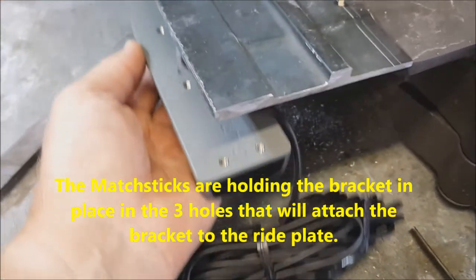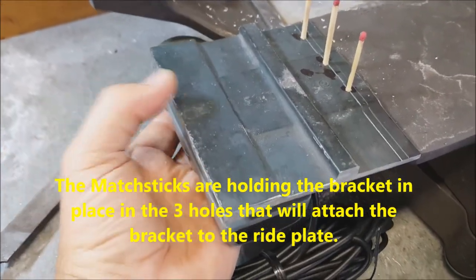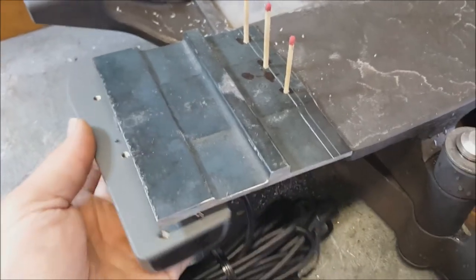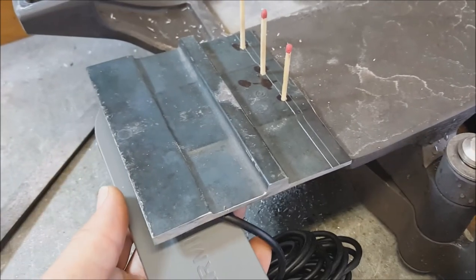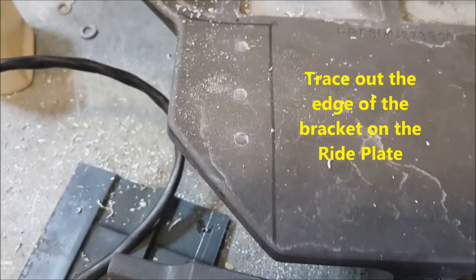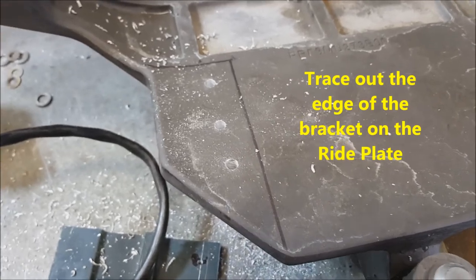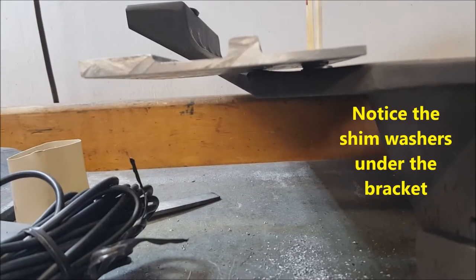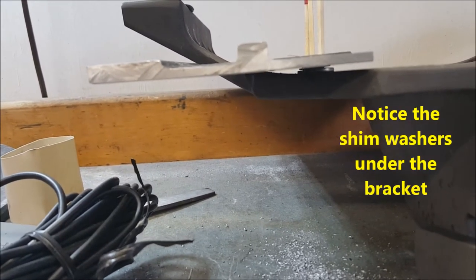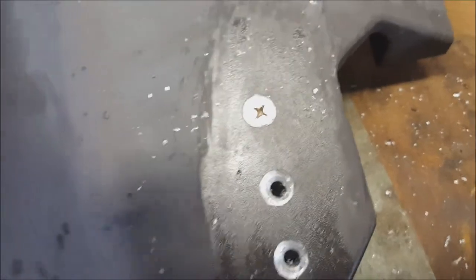The second thing, and this is the most important thing, is you've got to line up your transducer perfectly straight with the keel. Bow to stern, it has to be in a straight line. It can't be angled, or you're going to create a lot of side pressure, side cavitation on it. You want it pointing straight ahead so the cavitation that it creates while it's dragged through the water is minimal.